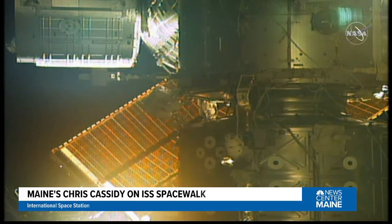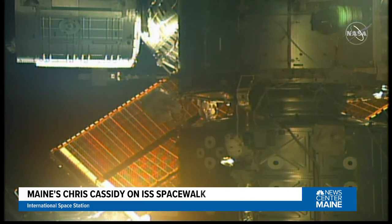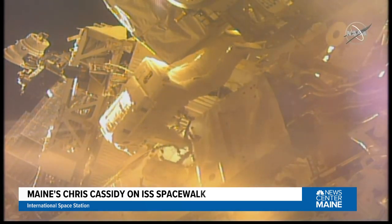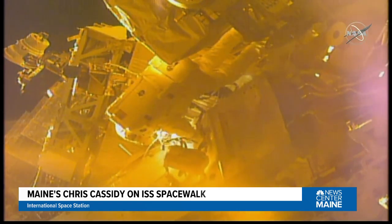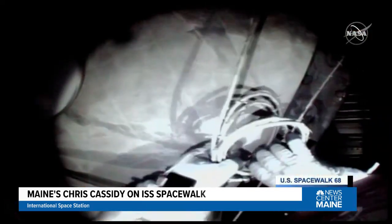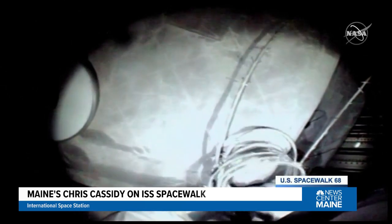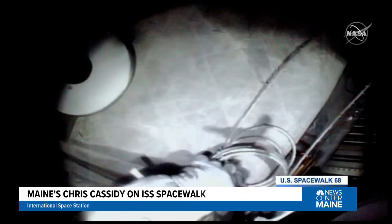Yeah, I'm pointing the GoPro along the length of the cable. On the port side, there is a strut or a cable tray of some sort that comes across. The cable goes underneath that into the original handrail it was tethered to. And then that original tether where it was holding the bundle is still captive of the cable, and I basically had this shortcut underneath the following two handrails, straight up and over that handrail that I gave you the number of that I had installed the wire tie on. Basically, I ended up skipping two of the circumferential handrails to get to that location.